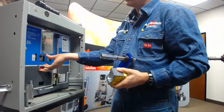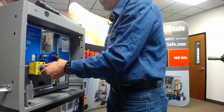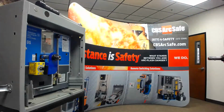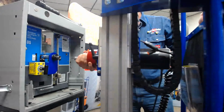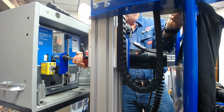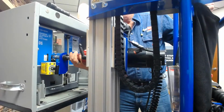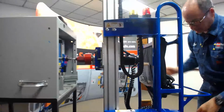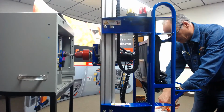Here's our tool. We'll push our trip button. We're going to open the door, install our tool. And there we go. Now we'll move the RRS-1 up. Okay, I've got to raise the motor just here. Got that. Now I'll put our motor brake back on because we don't want to impart additional energy in there. And I'm going to just take the numbers back down where I had it before, moving real quick.